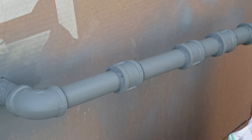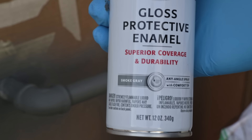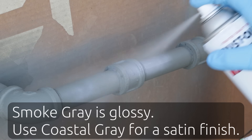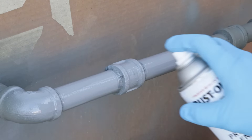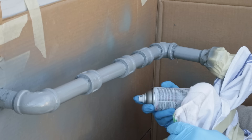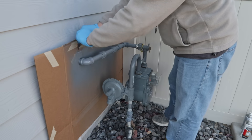Once the primer is completely dry, we're ready to apply the paint. I'm using this paint from Rustoleum — I'm not sponsored by them, this is just the paint I like to use. The specific color is smoke gray, and that matches really well for the gas meters at least in my area, and I suspect in most of North America — but double check if you're trying to match your colors. If your meter is a steely gray color, this is the one you want to use. I carefully applied three coats, making sure it had time to dry completely between each coat, and then after the paint had ample time to completely dry I went ahead and removed all of the masking.